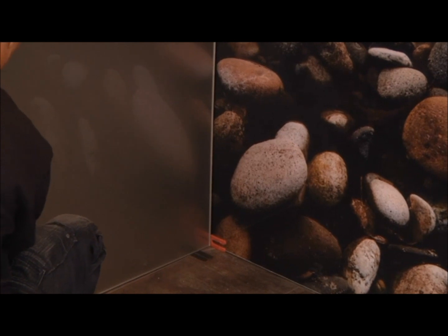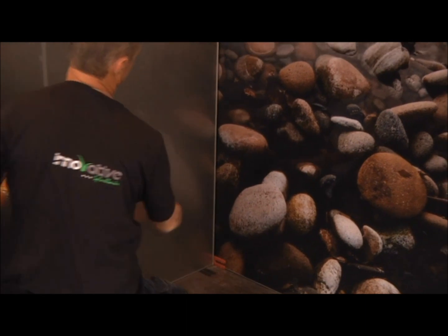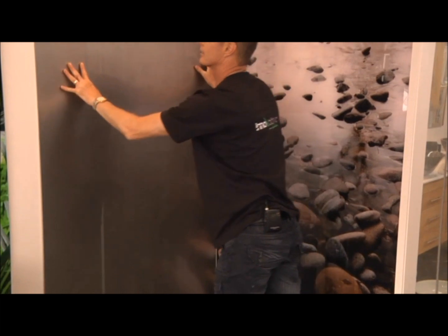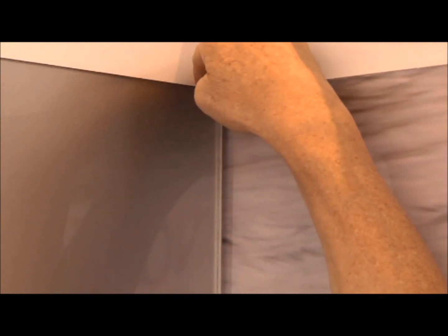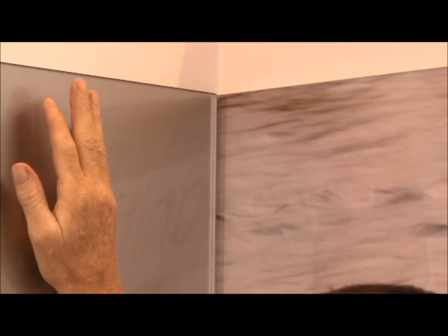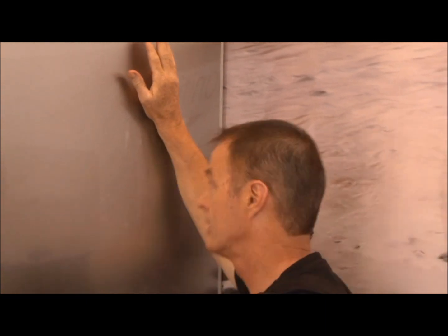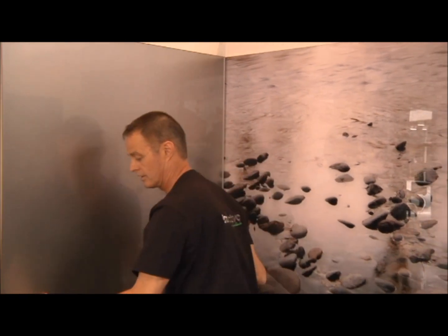And then from there, we've already adhered the silicone to our sheet. We now allow it to go back in, making sure we push all the silicone all the way through, and we feel here, and we can check our join at the top, and that's flush. Nice, clean, meeting each other. The silicone's still wet, so you do have time to maneuver it and adjust it to suit. So there we have it. We have our walls now fitted.